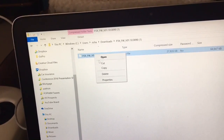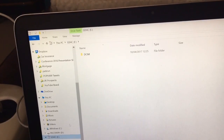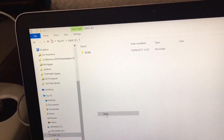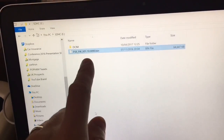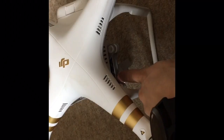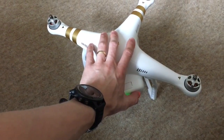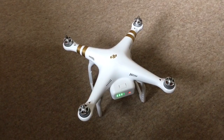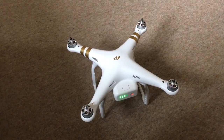You need to put this .bin file onto the SD card — I just pop it on there. You can now see the file is there. Put your micro SD back into your drone, then get your aircraft on. You are going to have to endure some of the beeping because what's happening is that SD card is installing that update.